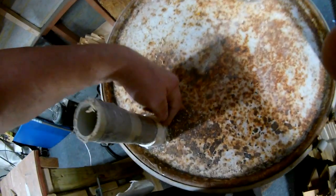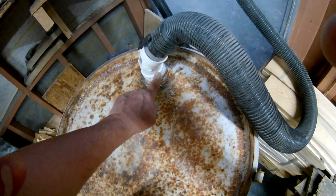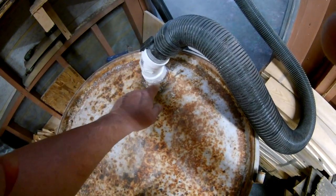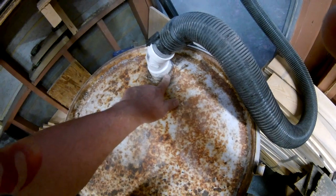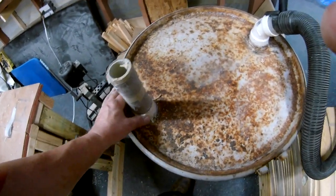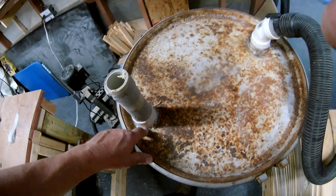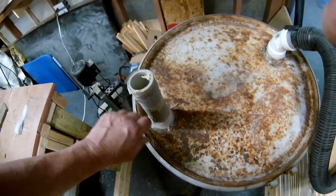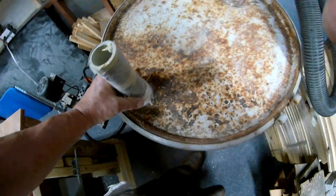That's how I did that with the two inch that's inside here. I went all the way down, marked it for the coupling height, cut it off, put this 45 on there. It's all put together with the hot glue gun - just in case I ever have to take this apart. If you use PVC glue you'll never be able to get them apart again, that glue is hell. So that's why I'm using the hot glue gun, because I can heat that up with a blow dryer and take the pipes apart if I have to. This is really sturdy.